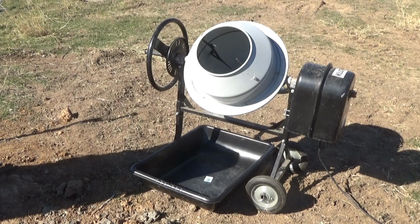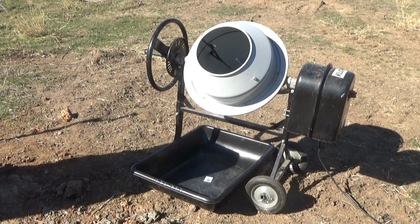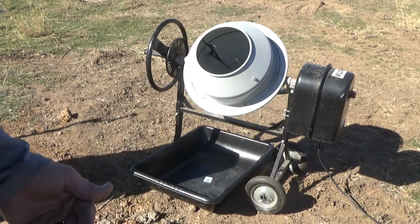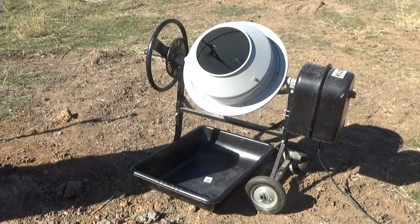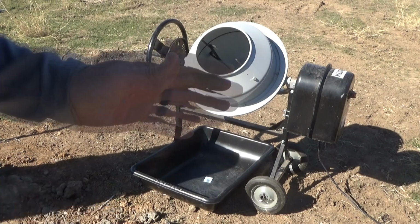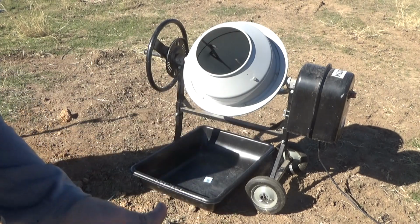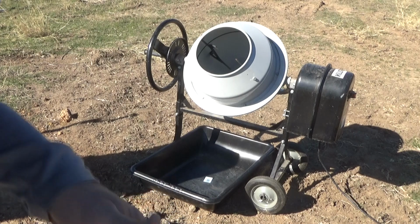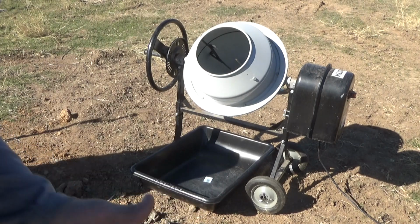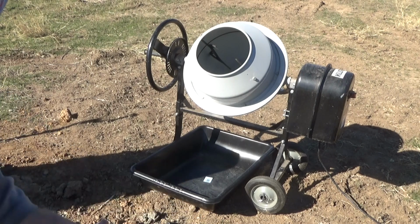So the one trick that I had mentioned in an earlier segment that I hadn't covered yet was, I don't know how much of a trick it is, but this is what I did, and I was blessed that it worked out like this from the first one, and I learned from it. What I've done out here is I put a level across the concrete pad and found that the course is not perfectly level. So I picked the highest block, and that's the first one I'm going to set. And I'm going to set that with mortar to 8 inches off of that slab. I'm going to measure that one corner. That seems to be the highest corner. And then I'm going to set it and level it.